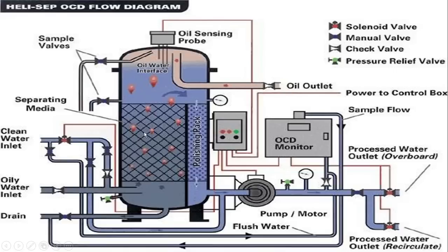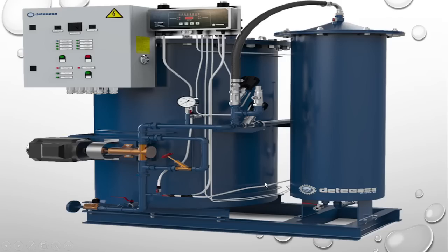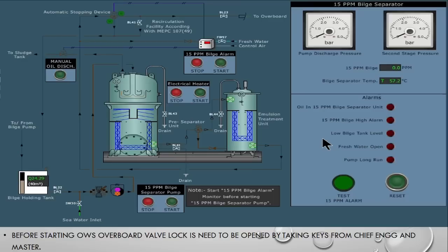How is it preventing marine pollution? The OWS ensures that all the bilge water collected on board in the engine room is passed through this OWS filtering equipment to ensure that oil content is less than 15 ppm — meaning in 1 million particles of water, the oil content should be only 15 parts per million. This is the regulation of MARPOL. If you want to know about the line diagram, you can watch the last video; you can find the link in the description.